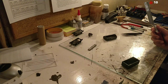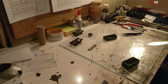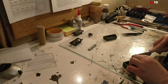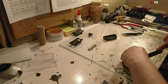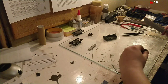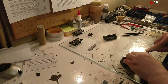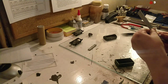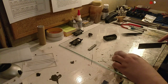I'm going to tell you this as a fact. Stephen has drawings, so could confirm. The curves on the sides didn't reach all the way out, and they started inside the actual planks for the sides. So for the purpose of these, you can indeed just cut down the side there to the correct depth, which I have marked by scoring in the edges. That's why I did that first. This one hasn't scored very well, so I'm just going to do that there, and I can see that better now.